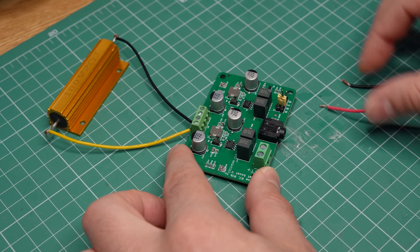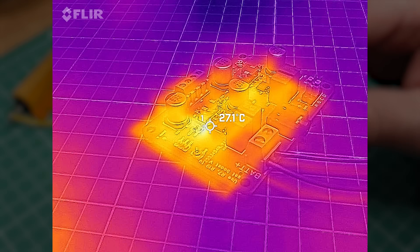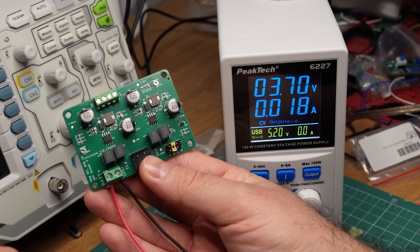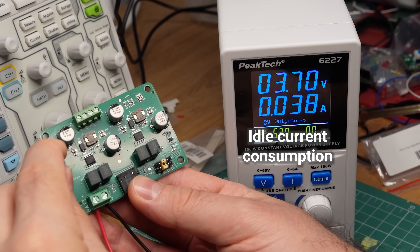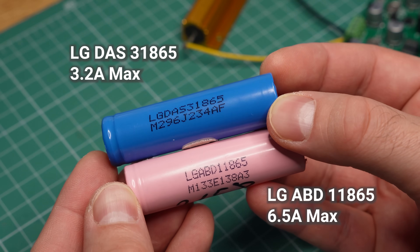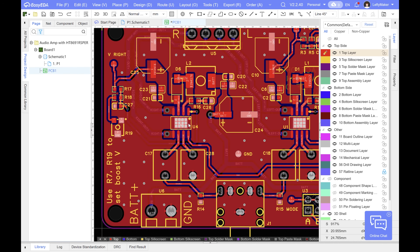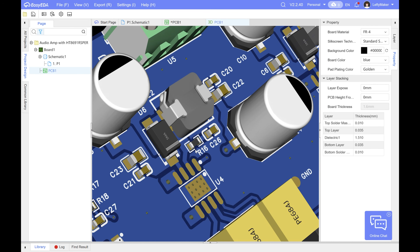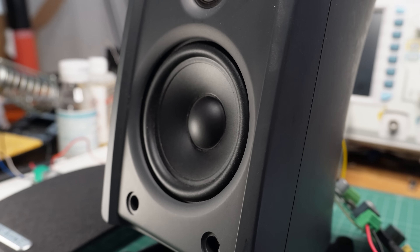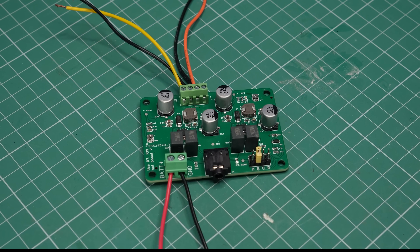So you might be wondering why this approach isn't more popular. I think there are several reasons. One of them is that the increase in power comes at the cost of efficiency — the boost converter cannot be 100% efficient. I measured the efficiency of the entire system to be around 60%, which is pretty bad for a Class D amp. In addition, the voltage booster consumes energy even when the amplifier is idle, and the higher the voltage boost, the more current it pulls. Another downside is that you need a high-quality battery that can supply lots of current, as the amplifier can easily pull several amps per channel. On top of that, the boost converter adds complexity and requires the PCB to be laid out correctly to avoid noise. But despite all this, I think this amplifier has potential. If you set it up properly without pushing it too much and give it a decent battery, it can serve as the base of a very capable portable speaker with plenty of powerful sound in a small package. Let me know if you want me to make one. Thank you for watching and I'll see you in the next video.